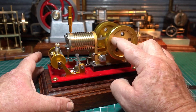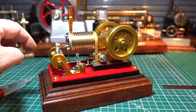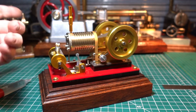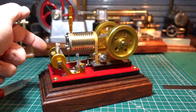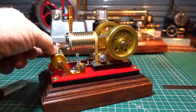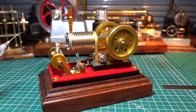I think it needs some smoothing out in places because it's rough, but we'll give it a run. Just fill up a syringe with some metho. What it comes with is just an aluminium bung plug that just literally sits on there, just as loose as anything. So I ran a tap down — there was enough meat on the spirit tank to run a tap down — and turned a little thumb screw on the lathe and drilled the air vent hole for it.